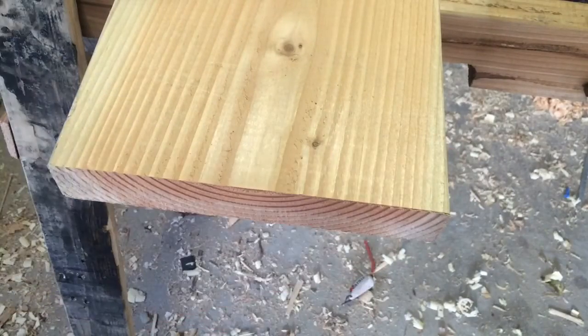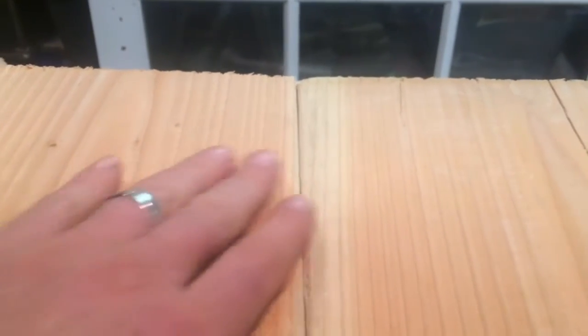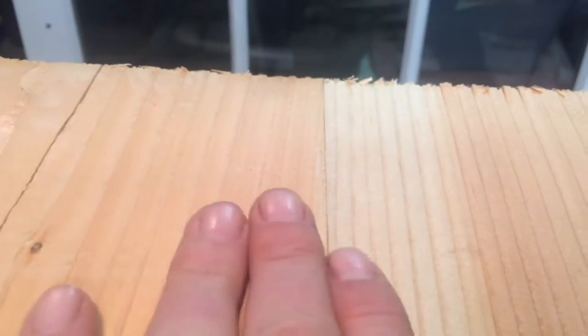I think that'll do. Now all my boards are cut, and this feels like a pretty good stopping spot lest this video run into 20 or 25 minutes long. Tune in next time because on the next installment, at the very least, we're going to go ahead and plane all the edges of the boards — so then instead of having a little valley where the boards meet, you instead have a nice even joint where you can barely tell where one ends and the next begins.